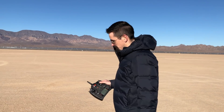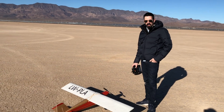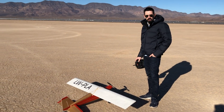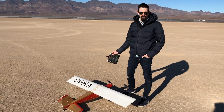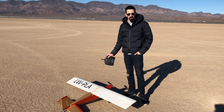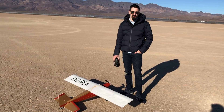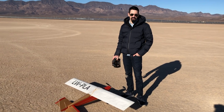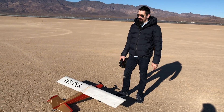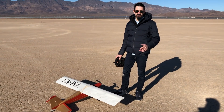That worked really good — this lightweight PLA is just awesome. This is from ColorFab and it's definitely well worth the money. It's only 40 grams over the 60-inch foam wing, there's no carbon fiber spar, I've got four 9-gram servos in there, and it comes in at 372 grams and just flies really good. This lightweight PLA is going to change the game for 3D printed airplanes — it's just as light as foam. Thanks for watching and we'll see you guys in the next build.